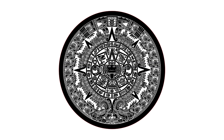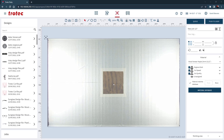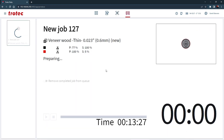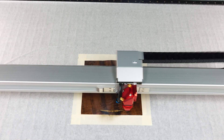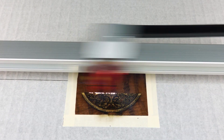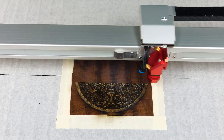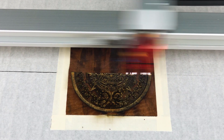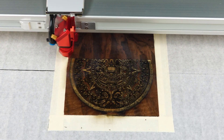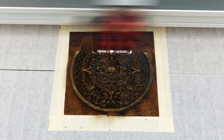Now import the mirrored and inverted graphic file into Ruby and place that file over the veneer wood in the laser. I have completed some advanced testing and created a custom veneer wood parameter setting — select that setting and push it to the laser. The parameter setting should be dialed in to engrave through the veneer but not through the application tape on the backside. Pre-testing is necessary to find this setting. In this example I am using a Speedy 400 with 120 watts of laser power at 100% power, 77% speed, 1000 Hz, and 1000 dpi.